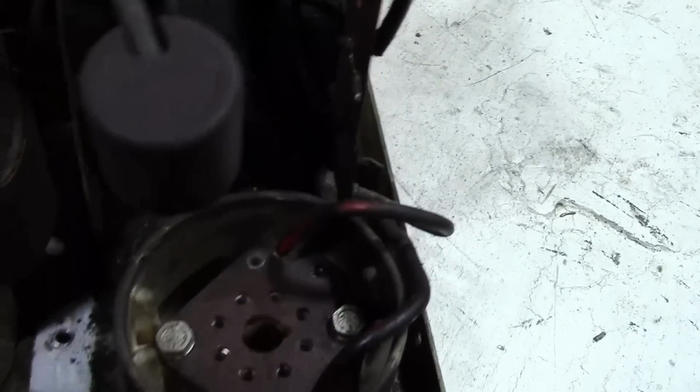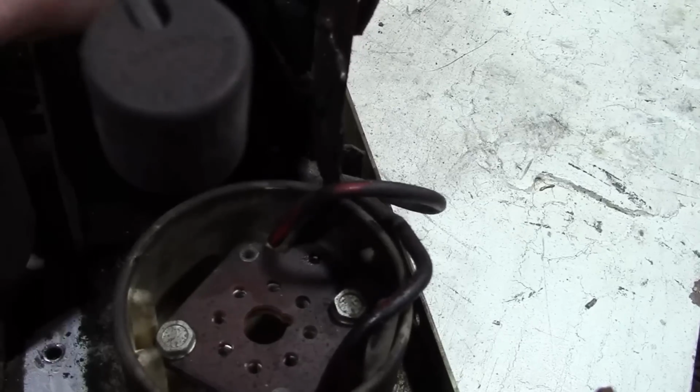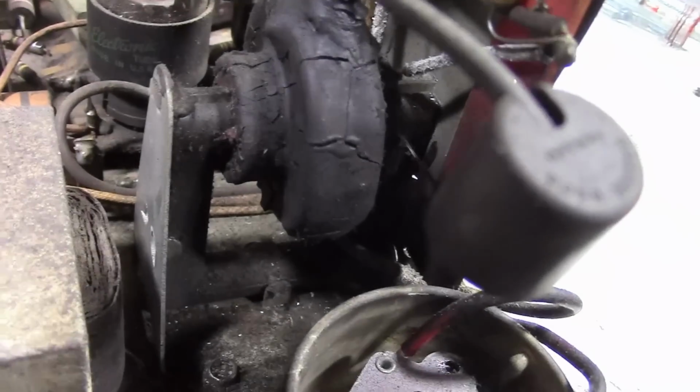I would not get too obsessive about trying to chip off all this old coating. In the past, I'd gotten some RTV 133, I think it was, and I completely removed all the wax and put that on. That's expensive stuff. It's really overkill for this. Just slap on some Corona dope and you'll be fine. That's what it's made for.